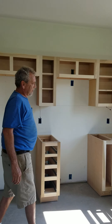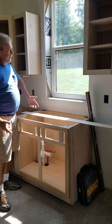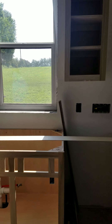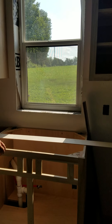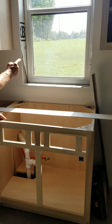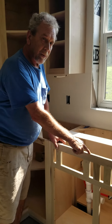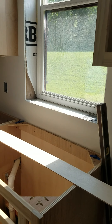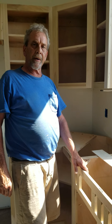You notice how this is the type of pre-thought that you have to give it. When you're ordering these cabinets, you want this thing to be centered up on your openings for your windows and such. You've got to make sure you've got that window right. When I framed this, I had to frame it with this in mind — where this cabinet was going to end up so that my sink would be lined up with the middle of this window. One thing kind of builds on another in construction.